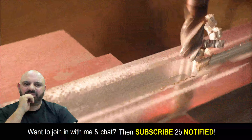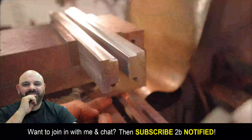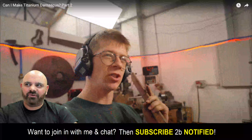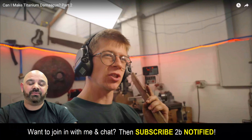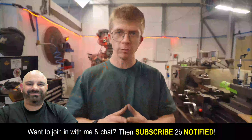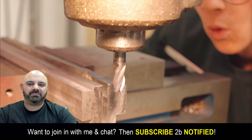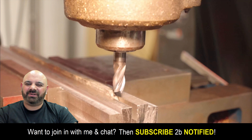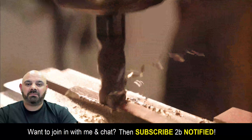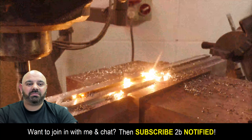You want to see some shenanigans? The end mill slipped out of the collet — delightful. Thanks to the blunder, I have a deep side of the soft jaw and a shallow side. I have actually hand forged my own dagger before, so I have done some forging. Just a very quick touch on the grinder, then we're going to make the sides parallel before we try and face it — we're not going to start a titanium fire, we're going to try very, very hard to avoid it. Using a 12 millimetre carbide end mill at 700 RPM, 1.5 millimetres depth of cut — it's cutting beautifully.